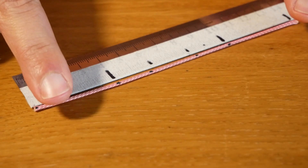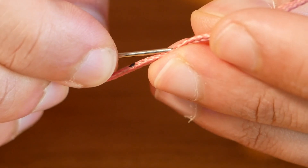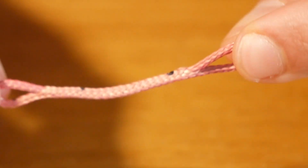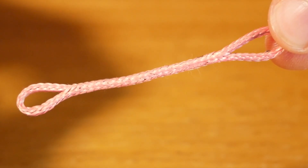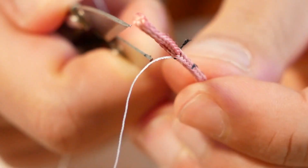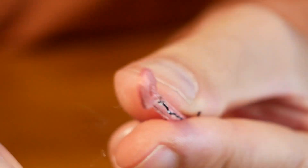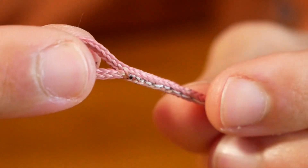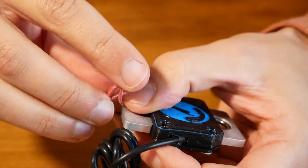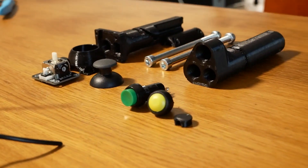The sensors were a bit too close to the handles, so I grabbed a little bit of line and spliced it in as small as I could go, giving me a bit of line with a loop on both ends. Then I went over to the sewing machine and tightened it together with a little bit of string so it doesn't undo itself, but most of the load is carried by the Chinese finger trap system, so I can thread those through — and that will be the way the sensor is attached to the rest of the handle.